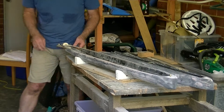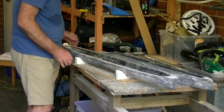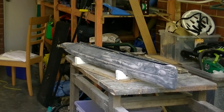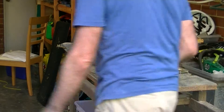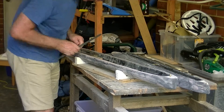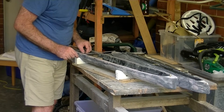That should now enable me to set this up so it's in the right position - horizontally, longitudinally, and everything. I've cleared a spot on the bench so I can get down in front of it, make sure the boat is properly upright, and look at the stern to make sure those props are perfectly right. I'm making sure that the shafts are even in terms of their vertical from the bottom of the boat, and that they're at exactly the right place in accordance with the plans - which was 55 mil at that point.